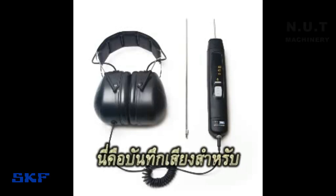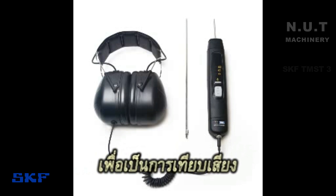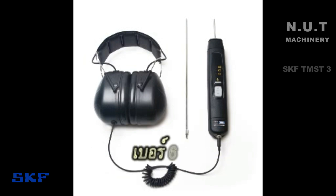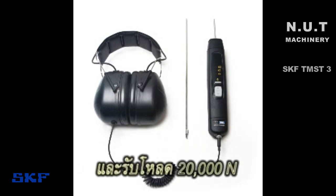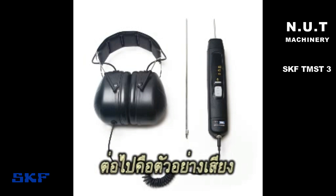The recordings have been made with the SKF electronic stethoscope, and in order to obtain sounds as comparable as possible, bearings of the same type and size, deep groove ball bearings 6309, operating at the same speed of 2,000 revolutions per minute, and under the same 20,000 Newton loading, have been used throughout.